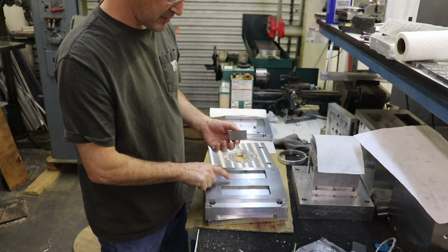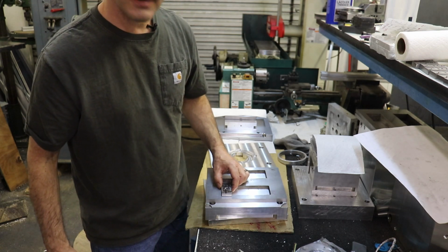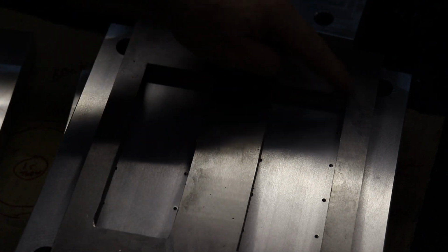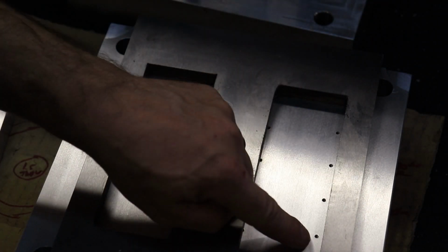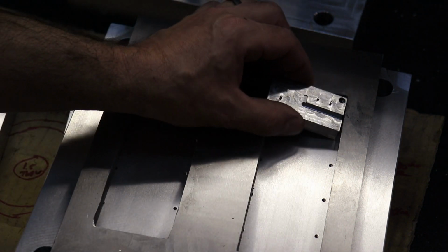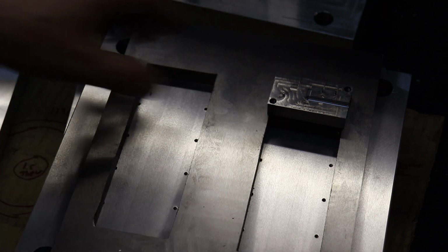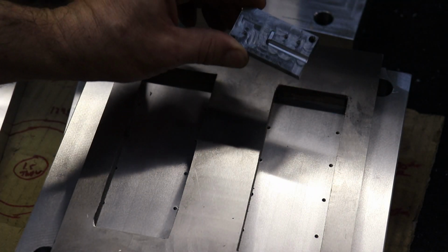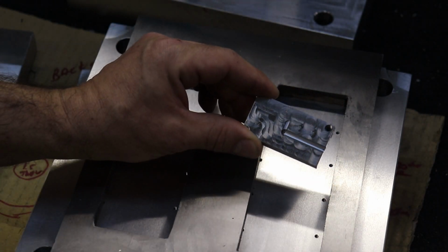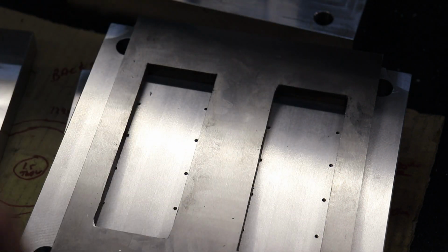And this outer steel frame is going to lock in these inserts, kind of like stacking dominoes, in the X and Y location. Yeah, so you can probably just peek past this rough EDM cut pocket to all of our little mounting holes that we have for mounting our core inserts. And all four sides of the mold will have an array of 10 of these inserts, so that'd be 40 of these inserts of various types that we are going to or continue to make. Ultimately, these are all going to be finished with the EDM machine.